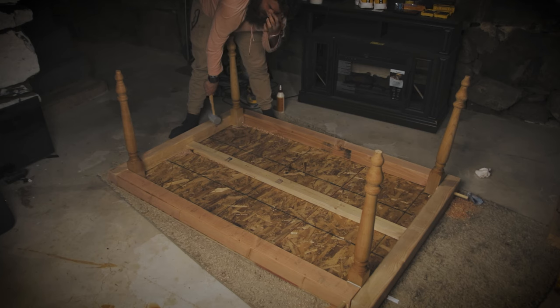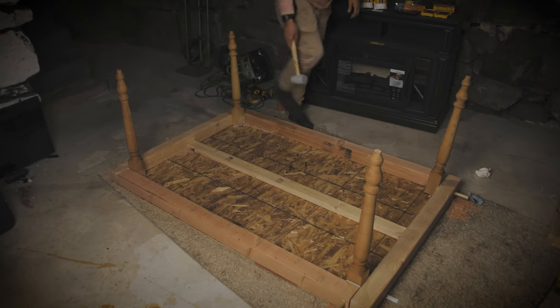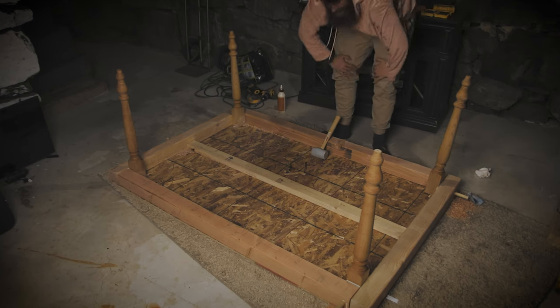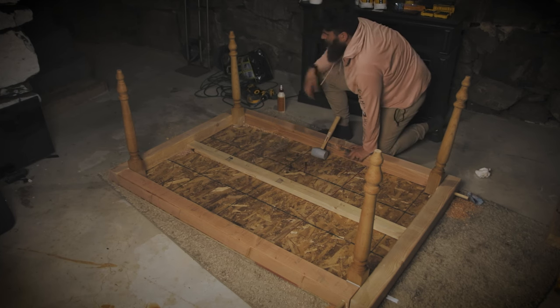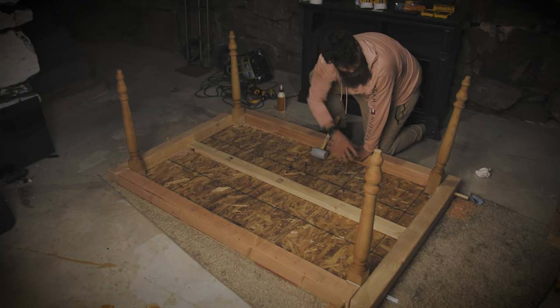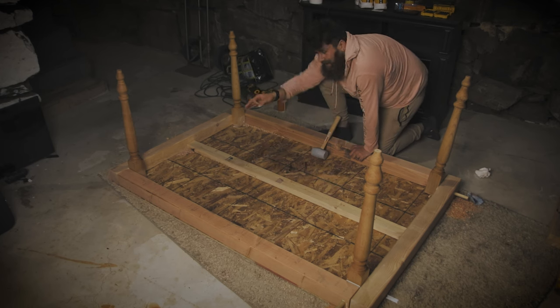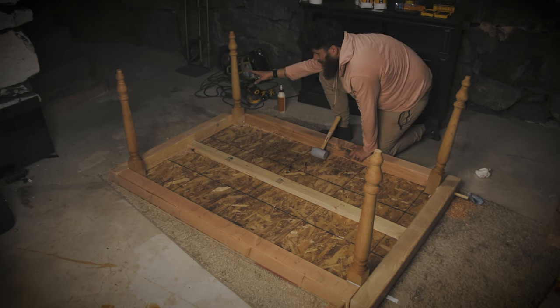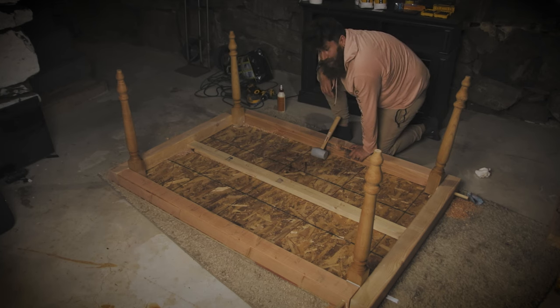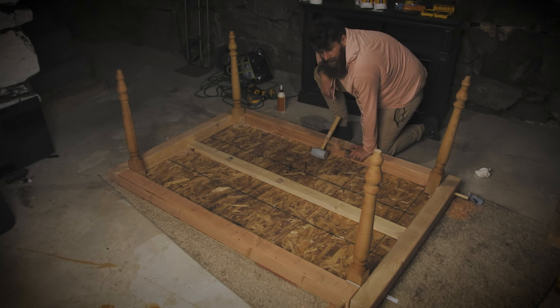Got a little aggressive on it there. Two or three more good hits and it's going to be abutted right against the other piece of wood. So I'm going to kneel down and catch my breath. These three table legs are solid as hell — they actually got more solid as I went because I got better at tapping the holes and working the dowel in. So we went from 'I don't love this leg at all,' to 'wow, that's impressive,' to 'oh my God, these are basically the same piece of wood.' Man, that's a workout. I'm going to pump a little extra wood glue into the seams, let these dry overnight, and go get some much-needed rest.